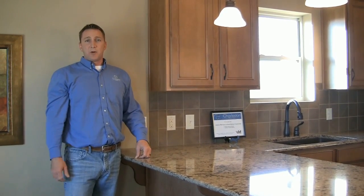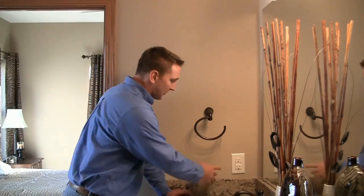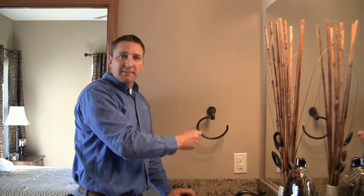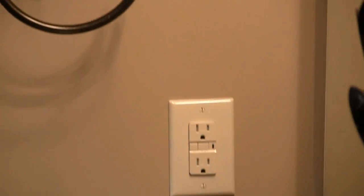Let's go check out a couple more. General rule of thumb — all of our bathrooms are connected. So if you have a half bath, a main bath, and a master bath, generally all the resets are tied to the master bathroom. The illuminated light means that outlet, or any of the electrical outlets it's tied to, will not work until reset.